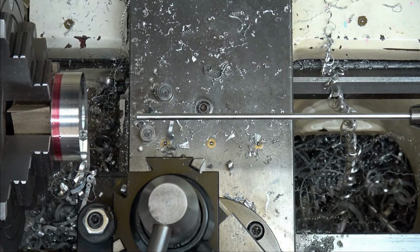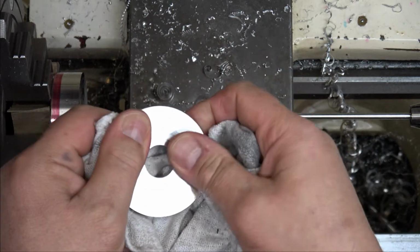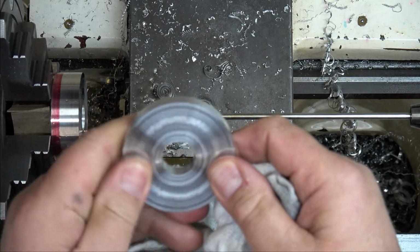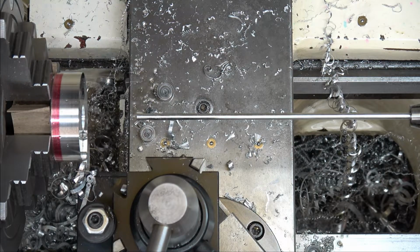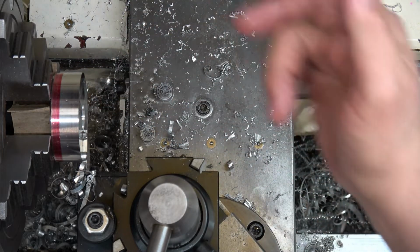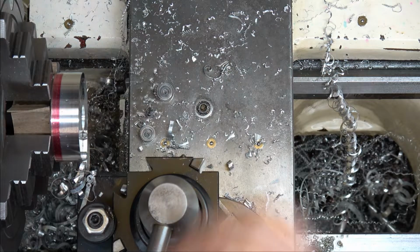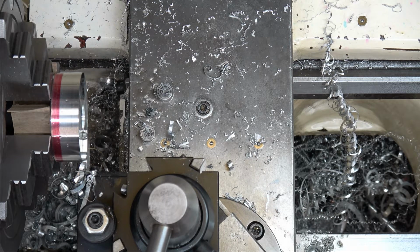A little warm. Right, that actually looks pretty good. It's smooth. It's got some different coloring in it, but it's smooth as glass. So we could put that back in the chuck later and put our chamfer on there, and we'll deal with that with the holes later. So we're just going to put the other tool back in, give it a quick skim, make sure it's dead flat. And then we're going to make our little offset feature so that our degree wheel will index on it or register on it. Okay, let me set up and I'll be right back.